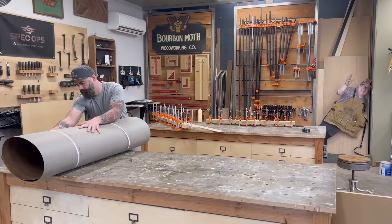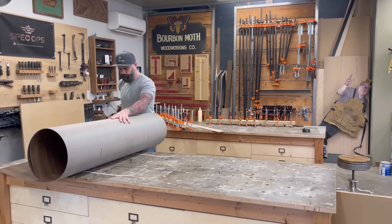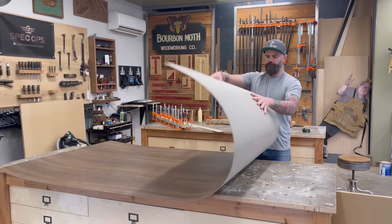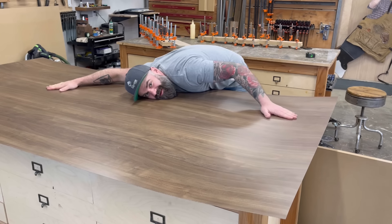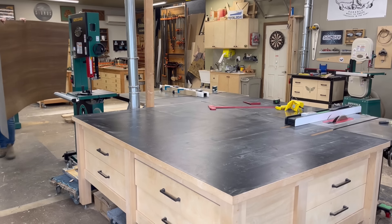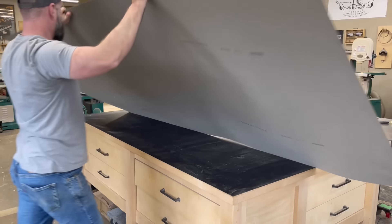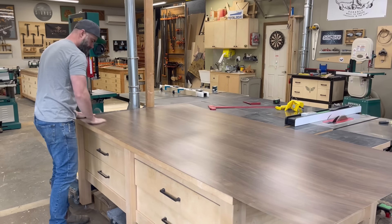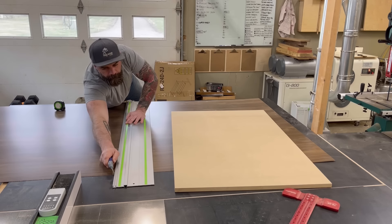Now, if you thought my crosscut sled was going to be completely made out of MDF, you're just crazy. I'm going to use the MDF as a substrate, but the true beauty is this walnut laminate I'm going to put on top. This isn't real walnut — it's walnut laminate or Formica, the type of material you might see on a kitchen counter. It's the same stuff I put on my work tables and my outfeed table because nothing sticks to it, it's easy to keep clean and maintain. It's also very easy to cut — you don't need any power tools. All you need is a straight edge, a tape measure, and a scorer — a little tool that etches a line on top of the laminate.